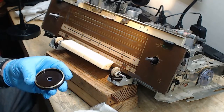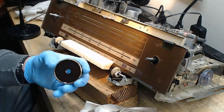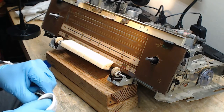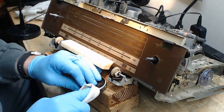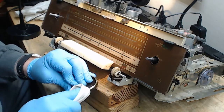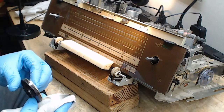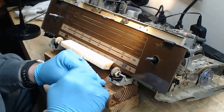Most of what I just polished won't be seen because it'll be behind the other knob, but you still need to give it continuity. You're not using much of the polishing compound at a time. Just so you know, I'm going to wash this knob afterward to get the polishing compound out of all the little fluting crevices. Make it pretty — this is where the image of the radio comes from for the owner. Give it that curb appeal. It doesn't matter how much compound gets into the fluting because I'm going to clean that out with a toothbrush and soap and water.